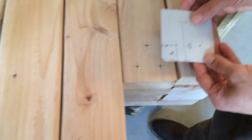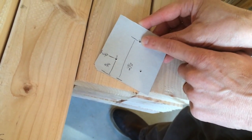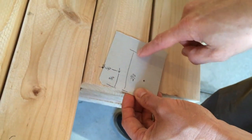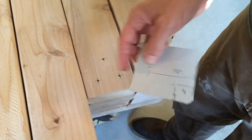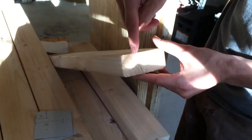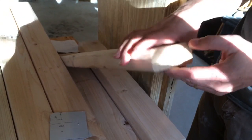For the 21-incher, it's only going to be three holes. Same — measure in three-quarter of an inch from the ends, and out to the center one is two and a half inches. Then measure your two-by-four and make sure that center one is dead center. Now we're going to use our template to pre-drill all of the holes into the ends. I'm going to drill completely through the board to have a hole that is half the size of the screw, to assist the screw to go in and connect to the other board.